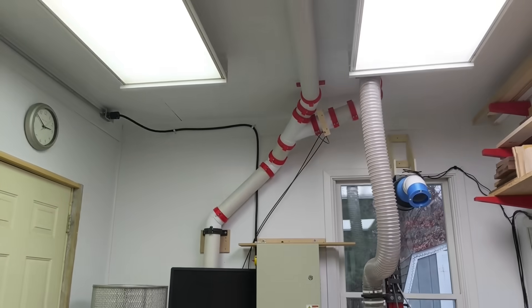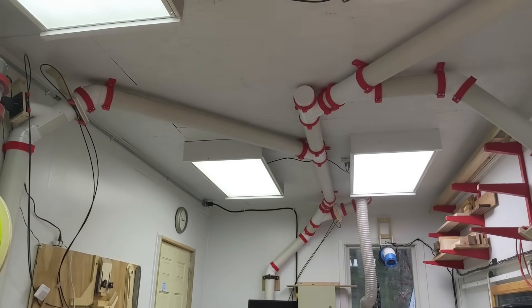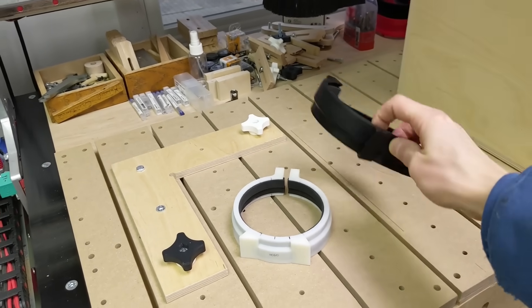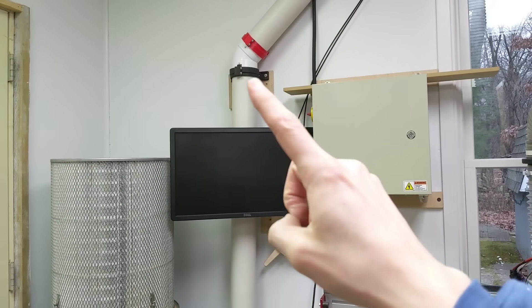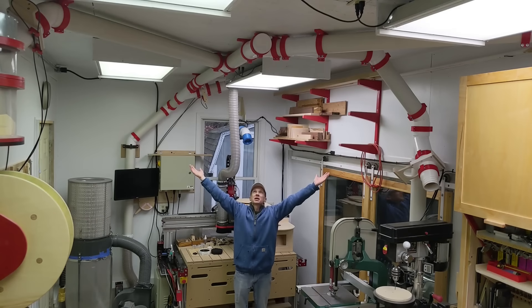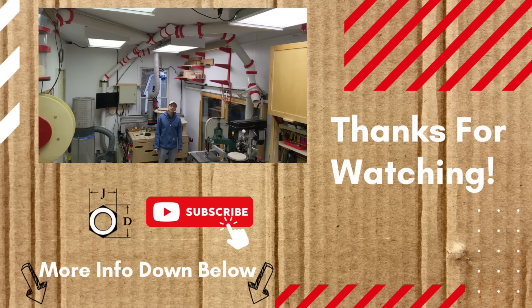It took me longer than expected, but now every single pipe joint has a gasket clamp on it — and if that's not a sealed system, I don't know what is. I was only able to install three of the gasket clamps from JLC3DP because I broke two while installing, and that's not a fault of the manufacturer but a fault of me picking materials that were too brittle and not flexible enough for this application. One of the SLA prints worked fine, my favorite is the SLS nylon printed one, and the PLA version matches all of my other ones. If you're into dust collection and want to print some of these for your workshop, I've got a detailed set of plans as well as the 3D files on my website. If you don't have a 3D printer yourself, you can check out JLC3DP to help you print some for your workshop. Thanks for watching and I'll see you in the next project.